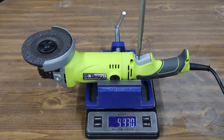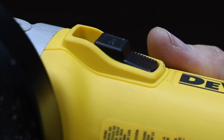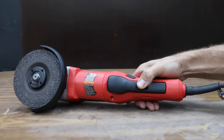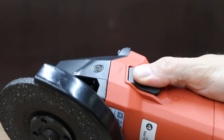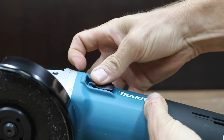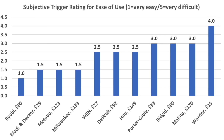The Ryobi takes the least force yet at 5.4 pounds — this grip style makes the Ryobi longer than most tools but extremely easy to use. The DeWalt takes the least force at 4.8 pounds and has enough of a carve-out making switch activation very easy with a direct pushing motion. The Metabo's paddle switch requires about 5.2 pounds of squeezing force, which feels much easier than a slide switch on a pipe handle. The Milwaukee's paddle switch requires only 3 pounds of force, and the more user-friendly handle size makes it very easy to manage. The Hilti takes 5.5 pounds and has done a great job with switch shape and functionality. The Makita requires 3.7 pounds but requires inward pressure while pushing to the on position, which may be difficult with sweaty or dirty hands. Over a tool's lifetime you'll use the power switch hundreds or thousands of times, and switch design is a bigger factor than force alone. Ryobi had the best ergonomics with a rating of 1, and Black & Decker, Metabo, and Milwaukee were also very user-friendly at 1.5.